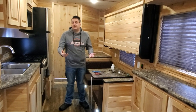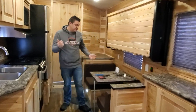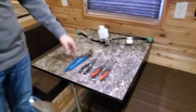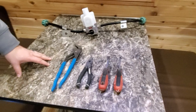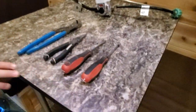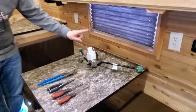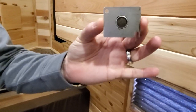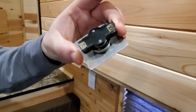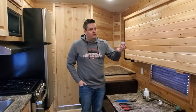I'm going to do it as fast as I can without missing anything, but there's a lot of information, so hopefully this video will help and serve as a guideline in the future. The first thing I'm going to start with is the tools I want to have with me. For the furnace you're going to need a Phillips, a flat screwdriver, some needle nose pliers, a channel lock, and then I always recommend — especially if you're going far out — an extra regulator and an extra limit switch specifically for the 30,000 BTU furnace. Both of these are available on GoIceFish.